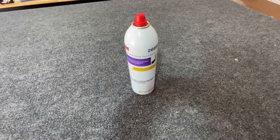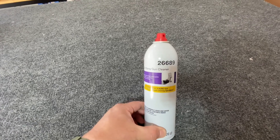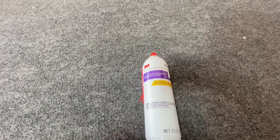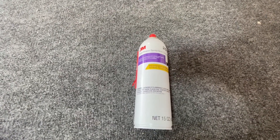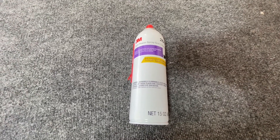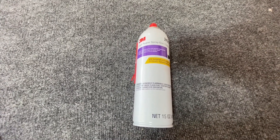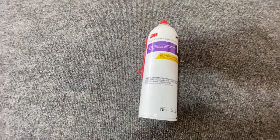To clean up my gun after I spray, I'm using this product — it's a 3M High Power Spray Gun Cleaner. I got this at Harbor Freight; they sell it other places but Harbor Freight had a pretty good price. It has a little straw like you'd see on WD-40 to help you get into the crevices. I found that spraying your gun down immediately — as soon as you're done painting, just soak it down — the primer comes right off. But if you wait even five minutes, you've got to work at it. The instructions for this paint actually recommend MEK as a cleanup; unfortunately I can't find real MEK anywhere locally so I'll have to order it online. But as long as you attack the gun really quick right after you're done spraying, this is basically just high-pressure acetone and it does really well.